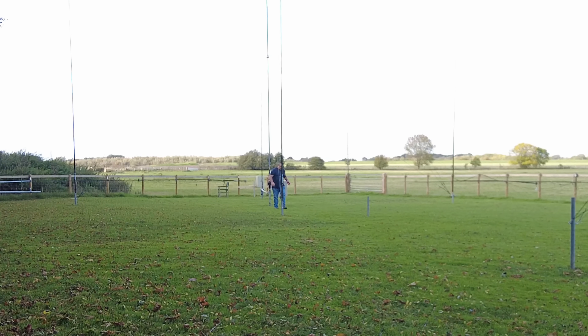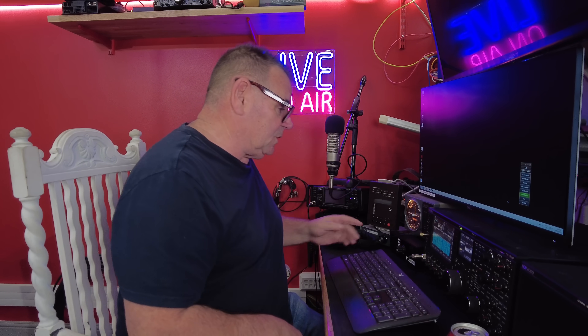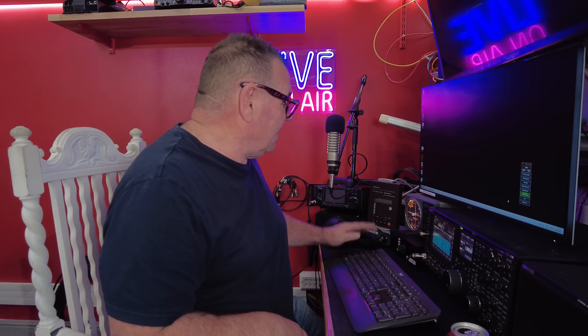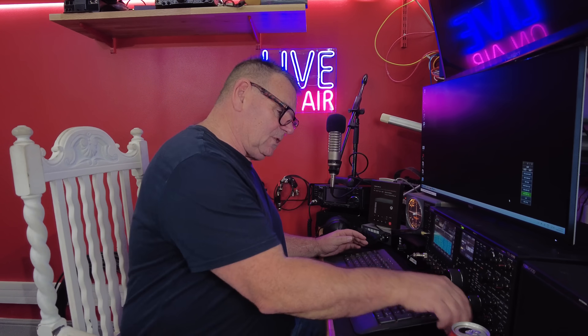That's quite interesting because the frequency is lower again — I guess the impedance will be lower too, because there's a percentage of frequency to height above the ground. The best tune I'm getting now is about 2:1 — the amp will handle that fine. It wasn't like 3.5:1 earlier. Further up the band we'll just have a listen.